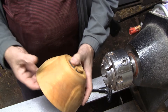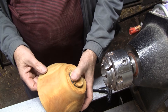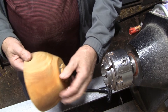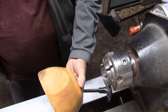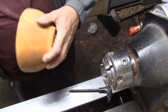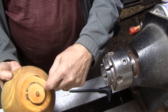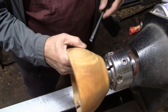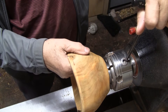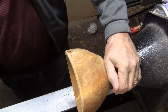After sanding this with the mineral oil in 80 grit, I let it sit for two and a half days or so while I finished up my segment turning. Wow, look at the colors in this. It did warp a little bit this way and it has kind of a rooftop shape which I don't really like. I would just as soon flatten this out and I think it will really be a pretty bowl. It measures about 11% on the base, so I think it's pretty dry for around here. This is really dry compared to the rain we just had — it was a monsoon coming down.